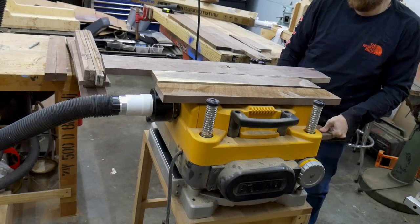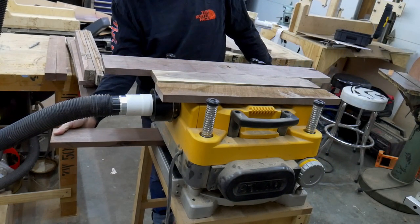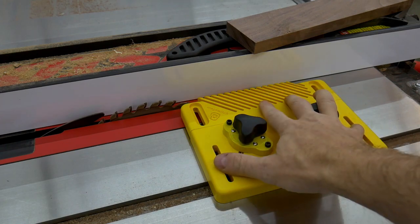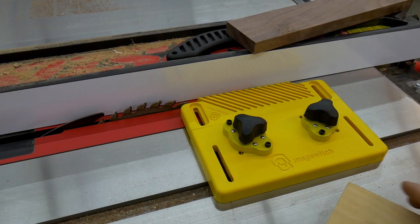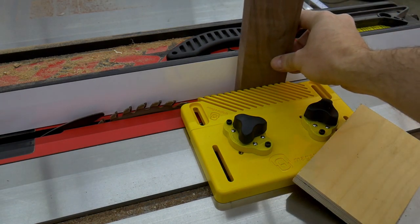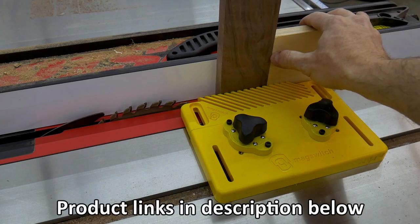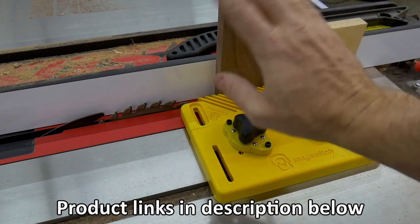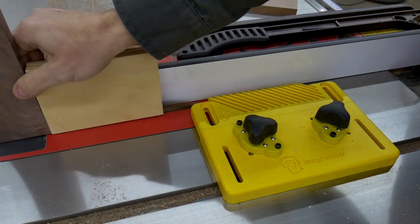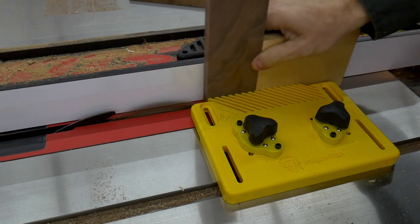At this point I want all my boards to be the same thickness, so I run them through the planer until they are just a hair thicker than three quarters of an inch. Here is the setup for cutting the grooves that will accept the splines. I use a feather board to hold the piece tight to the fence. Then I back up the cut with a square piece of wood to stabilize the cut and to keep the board perpendicular to the saw. I am a big fan of these mag switch feather boards because you can easily lock them down in just about any position as long as it is on a magnetic surface. I cut the spline groove in two passes, rotating the board 180 degrees to ensure a perfectly centered groove.